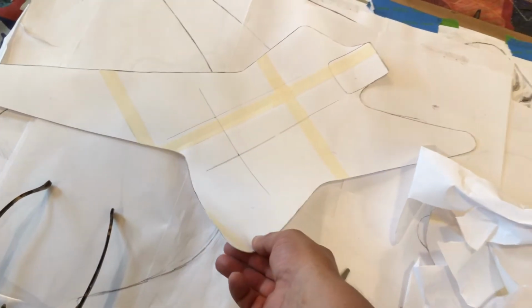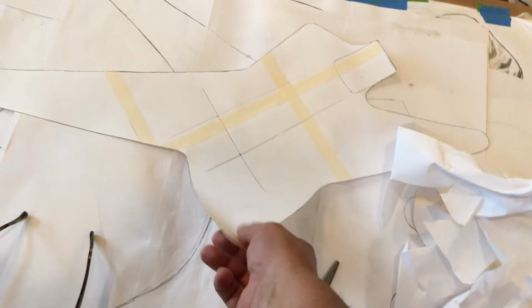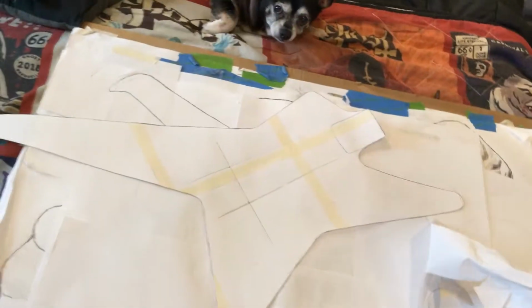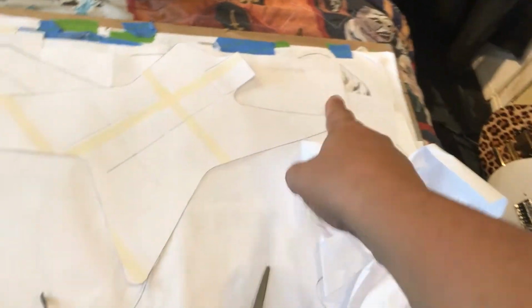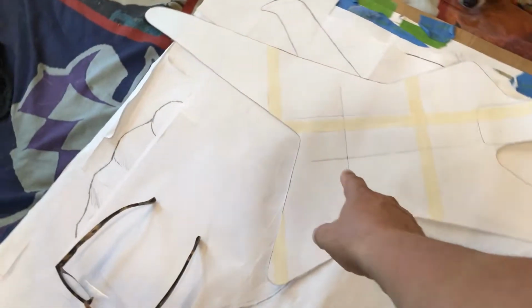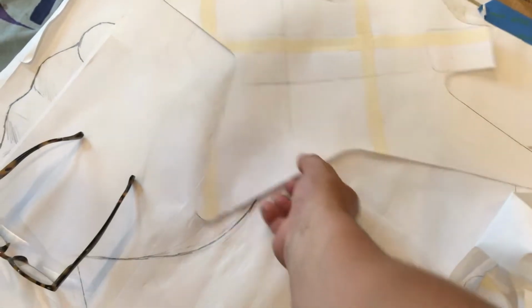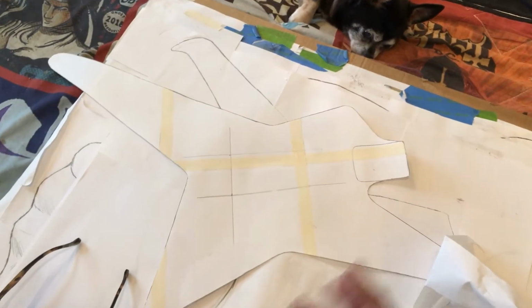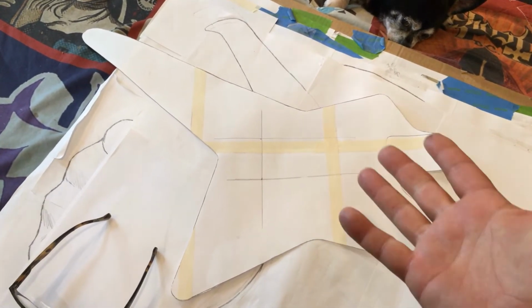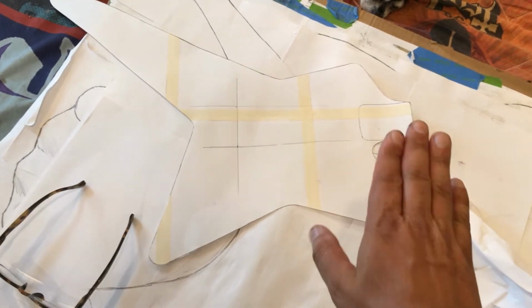Alright, got the paper cut out. The cutout is cut out. Anyway, first I'm going to measure this, and then we're going to go get some wood ready. And I'm going to do, like I said, a 2-point Strat style bridge on this guitar. So I'm going to have 3 layers: 1 layer of 5/8 plywood, and then 2 layers of 1/2 inch on top.